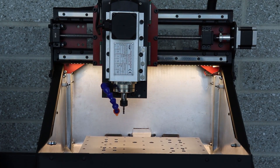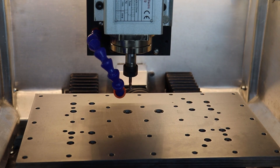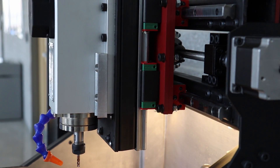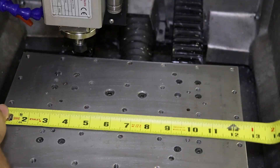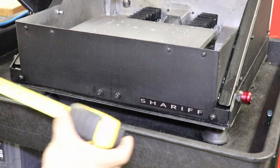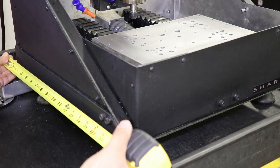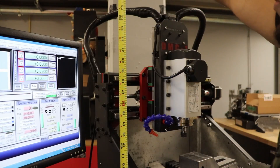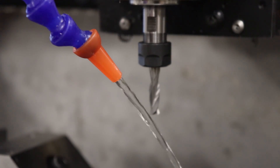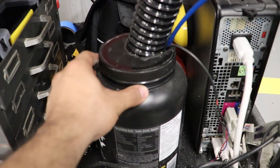The DMC-1 is a 3-axis CNC milling machine. The X-axis travels 12 inches, the Y travels 8 inches, and the Z travels about 5.5 inches. The bed in the machine is also these exact Y and X dimensions of 8 inches and 12 inches respectively. The entire machine covers an area of about 20 inches wide by 20 inches deep and 28 inches tall at full height. The machine does have flood coolant, which requires you to place a small bucket for a reservoir somewhere below the machine.